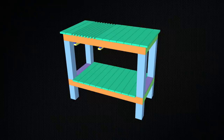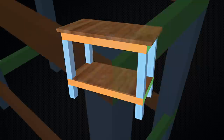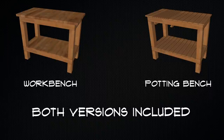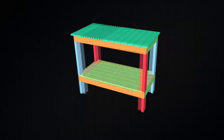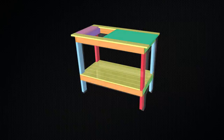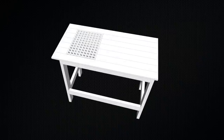Here's the final design I settled on. This is an outdoor bench so it's got slats that are spaced apart so water can get through. It would be perfect for a workbench, and you could put a layer of three-quarter inch plywood — or even better, laminate two layers of three-quarter inch plywood — for a nice solid work surface. The joinery lends itself really nicely to an indoor workbench too. I'll have a measured drawing and cut list available for anyone interested. Here you can see other iterations that involved 2x4s where the legs weren't symmetrical, slats going in various directions, and different structures underneath. One had 4x4s that weren't symmetrical, one had slats going in the opposite direction with a kind of basin. My original design was from way back when CAD was in black and white, and that had some grill grate thing that I think overcomplicated it.